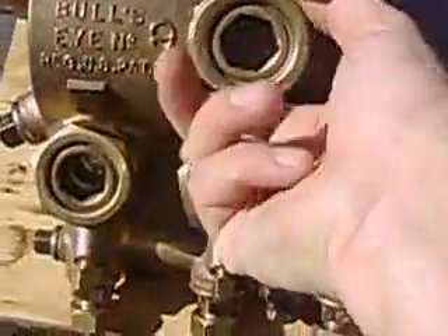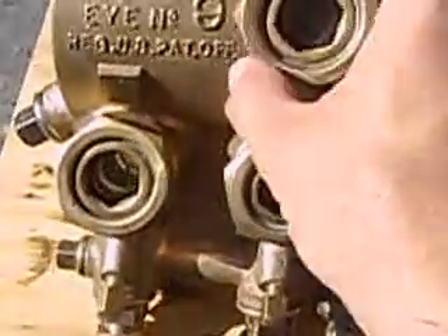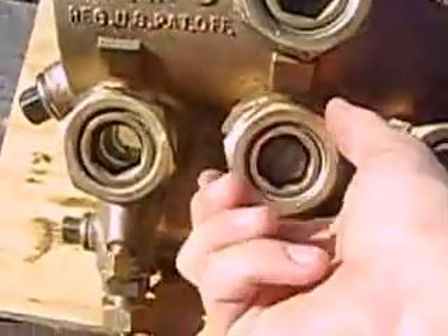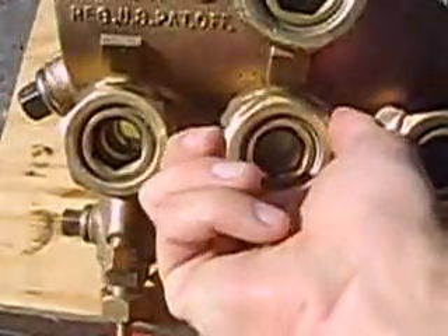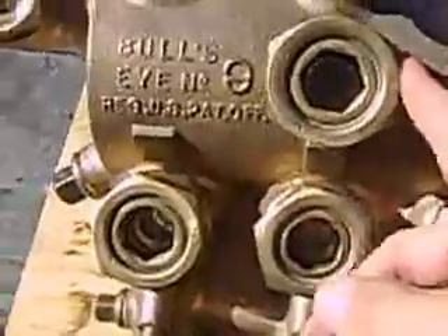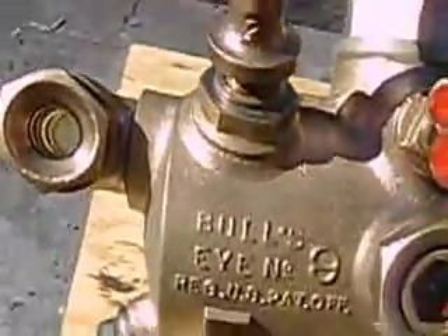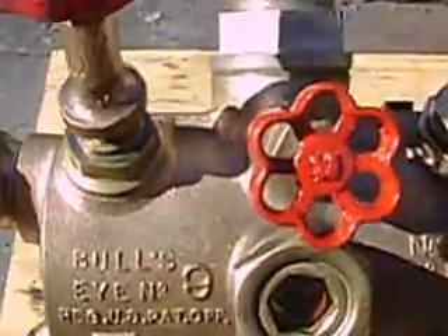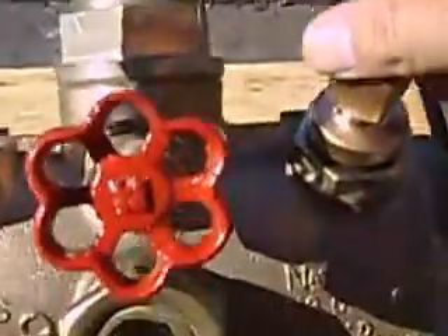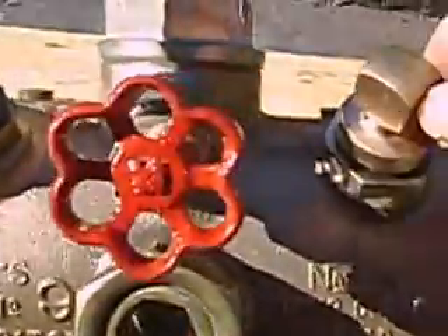This here is a spare glass in case you broke the Pyrex glass that's in here or had a really bad leak. You just had a spare glass — you could use whatever wrench, or even a hammer, to take it off and add a new glass. This handle here is for filling the reservoir. This is the steam shutoff for the reservoir, and then the main steam shutoff was typically on the turret on the other end of the line. This is also a fill plug if this one was easier to get to.